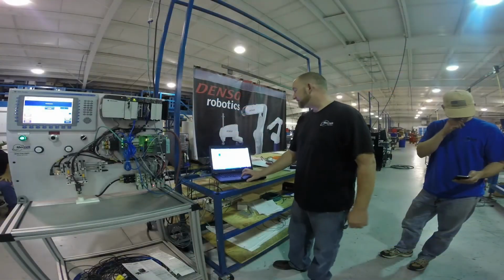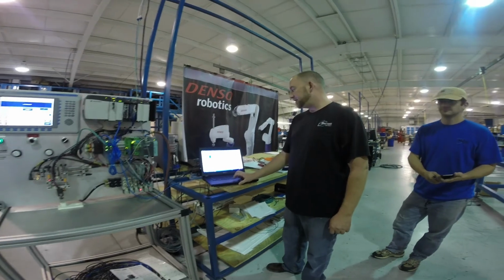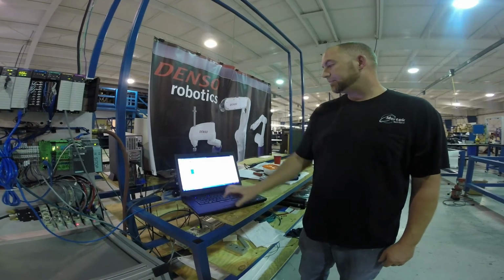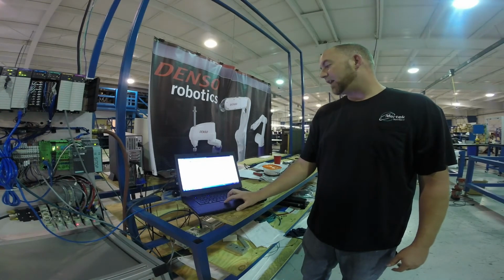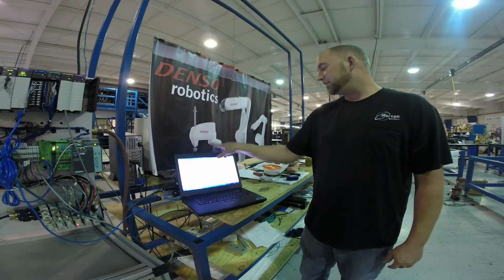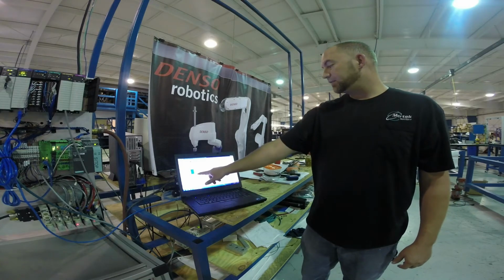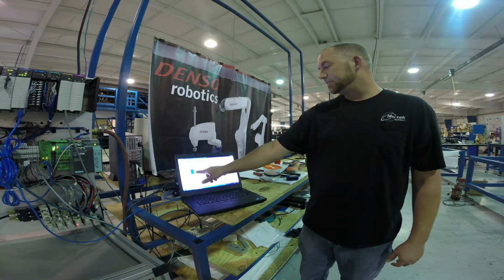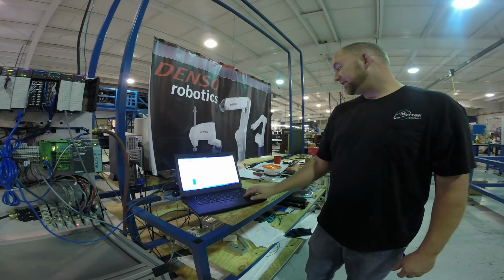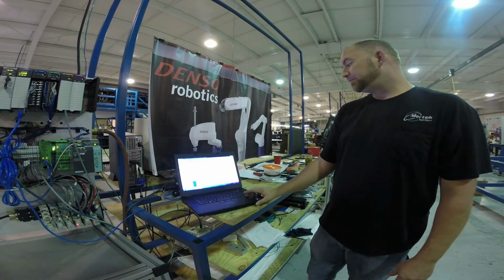Alright, this is the software that we use to program. There are push buttons, what we call normally open contacts. The power flows, called ladder logic because it's set up like a ladder. There are rails on each side and rungs in the middle. Through the contacts, you can tell if it's running, if it's green. So right now, nobody's hitting this button. So basically, if the power's not on, then we clear everything out to home.